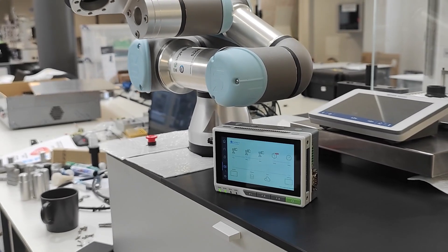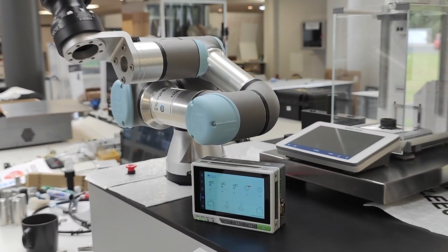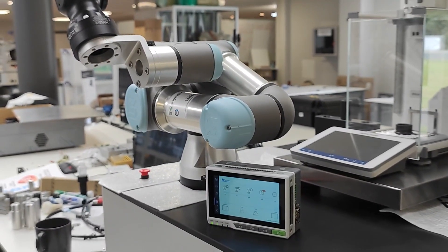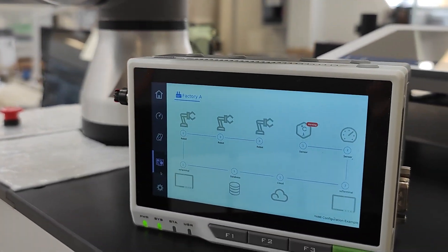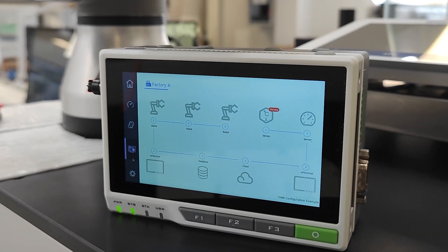While there are other ways to interact with all those peripherals, you have to say that using the E10-1 is pretty cool. You could use a small Arduino or another development board to test something quick to make sure your industrial machine is working. Trying makeshift controllers on a very expensive robot is generally frowned upon — however, exceptions do happen. In my case, as component shortages are quite real and I'm assigned to build two robots right now that I know I won't be able to complete due to shortages until February 2023, this gives me an opportunity to build and test individual RS-485 components to make sure the platform is fully working while I'm awaiting the brains of my robot to arrive later this year.